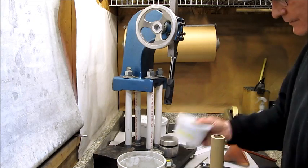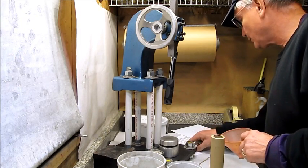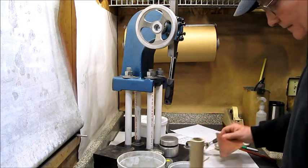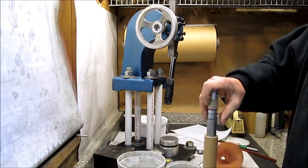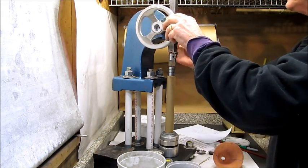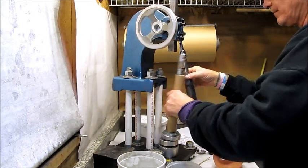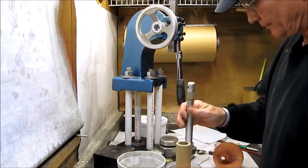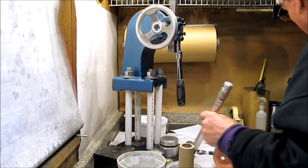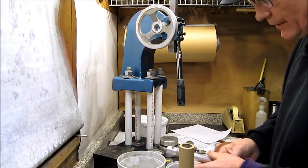Now I'll start with propellant. This has been slightly dampened with half a percent of moisture, and I want to use around 1-teaspoon increments. That has brought me up to my change-rammer line on the first rammer. I'll make sure it's cleaned out and clean any wax off the outside of the rammer with some steel wool. My lines are still nice and fresh on that rammer.